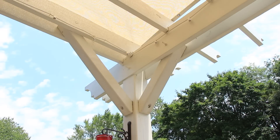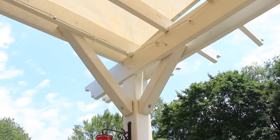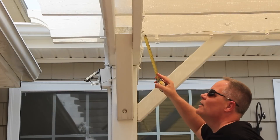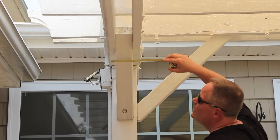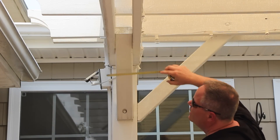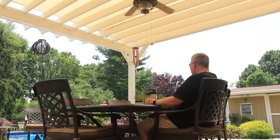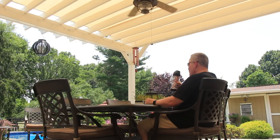Let's talk about fasteners for a minute. The structural parts were initially screwed and then bolted together using galvanized bolts and exterior deck screws. Three-eighths inch carriage bolt, 8 inches long, with a nut and washer on the other side — galvanized. Be sure to tighten the bolts from time to time because the wood will shrink.